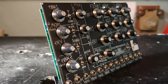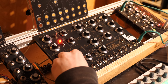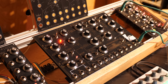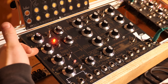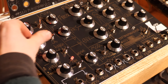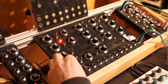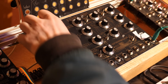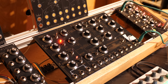Let's have a closer look at the functions of the crossfobber — I can't even remember the name of it, I should have made it a sensible name. I'm just going to run through a couple of things. It's got tune one for the first oscillator, there's modulation. If you flick it down to this, it just gets modulated by the second oscillator which is the tuner down here. That doubles up as an LFO of course. But if you flick it up to the top mode, what that does is it makes it go through a kind of voltage controlled LFO circuit.